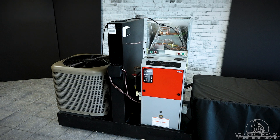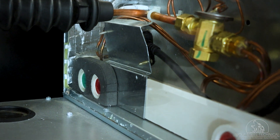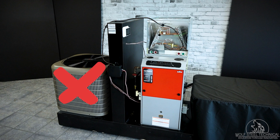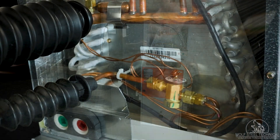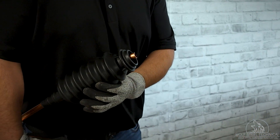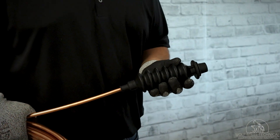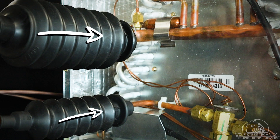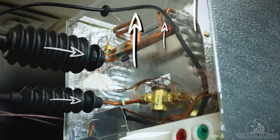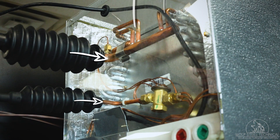When the sensor detects a concentration of 12.5% of the lower flammability limit, it identifies this as a leak and sends a signal to the mitigation board, which will shut off the outdoor unit and turn on the blower to dilute the air in the system. To protect against leaks at the liquid and suction line connections, the mitigation sleeves are placed over the lines before brazing them to the coil. These will direct the refrigerant into the cabinet, confining it to the ductwork and allowing the furnace or air handler to dilute the air in the building.